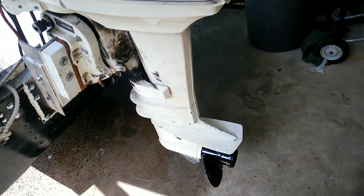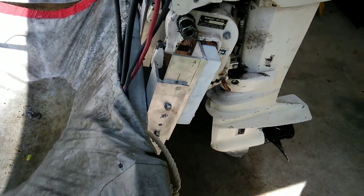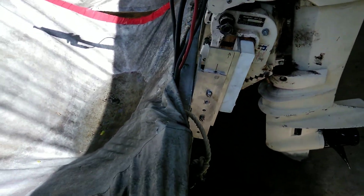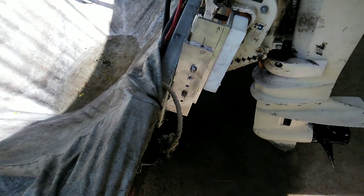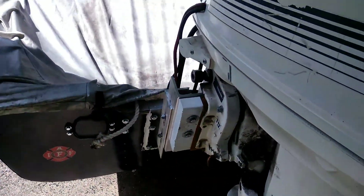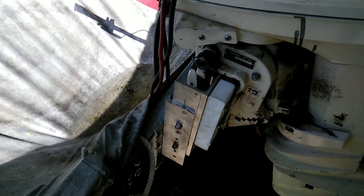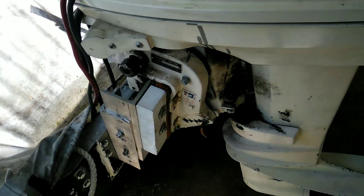All these parts you can get at Home Depot, except for the aluminum — I got that at Grainger's. I ordered it online and picked it up in store: forty dollars for a four-foot long quarter-inch section. It was pretty easy to put together — some trial and error, a couple trips to Home Depot to get the right bolts, but it works awesome. Would highly recommend if this is something you feel like you can do. The hardest part, depending on who you are, is either measuring or cutting the aluminum. I probably went through four discs on my cutoff wheel cutting through it.